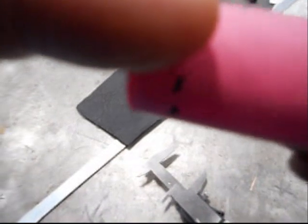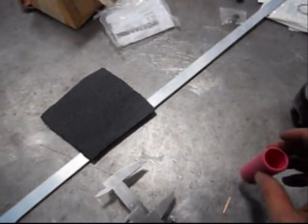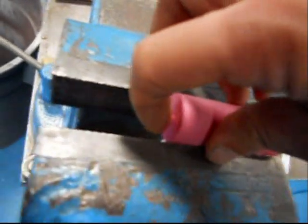That tells me how much of a solid plug I've got to the very inside base of that, because keep in mind a drill bit isn't going to cut flat. It's going to leave an angle in there for whatever distance the drill bit goes. The bigger the drill bit, the more of an angle, the deeper the angle. So I'll get this marked out.